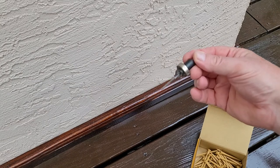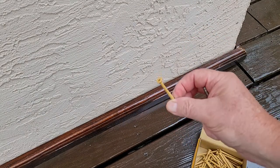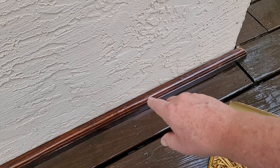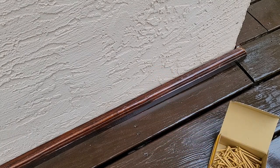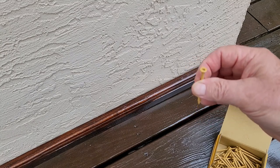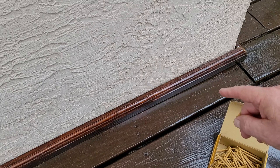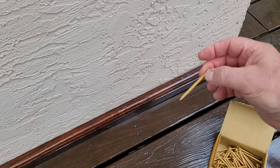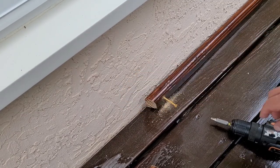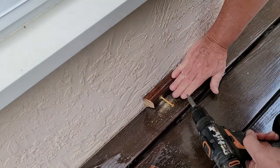It's time to hook the molding down. What I'm going to do is drill through first and countersink slightly. I'm going to use two-and-a-half-inch deck screws. I'm not going to put very many screws in this — each board I'll go with two screws unless it's super long and then I'll try three. I just need to kind of hold it in place. I went with screws as opposed to stapling it in — I could use my staple gun — but I do like the opportunity to be able to pull these up if need be and restain them over time. I ended up going horizontally rather than down because there's a lot of places where there is no board back there to catch, and this also pulls it against the wall better.